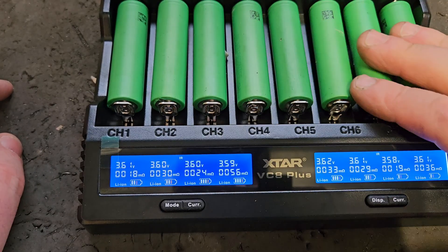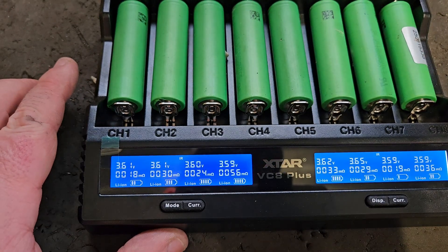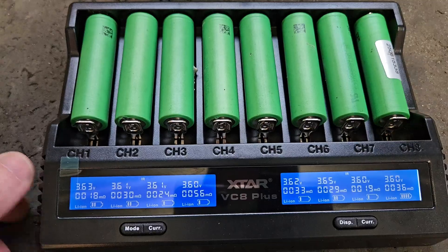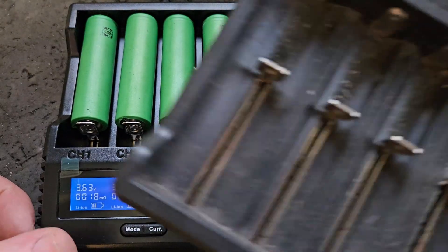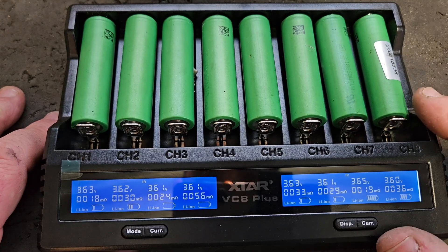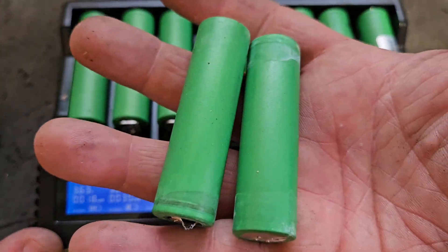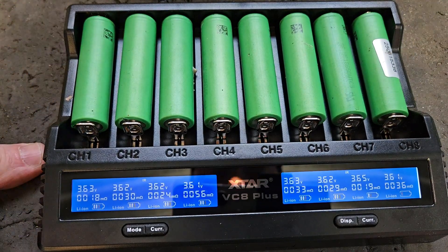These are charging away. I need to bring two of them up to 3.7 volts to fit into a Milwaukee battery — there's a Milwaukee battery I have here with two defective cells in it. I bought this charger for more efficient, quicker charging of replacement cells. I also have this VC4 — same brand, Xtar VC4 — which only charges four cells at a time, but this one charges eight. Between the two of them I can charge a whole battery pack fully in a really short time. You need about 10 cells for a standard 18V/20V battery pack — that's why I bought this. It's going to be ideal and perfect for my battery repair work going forward.